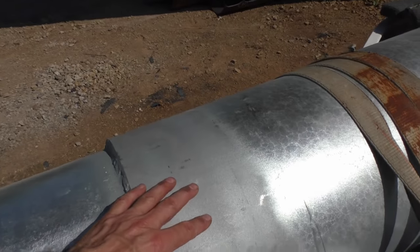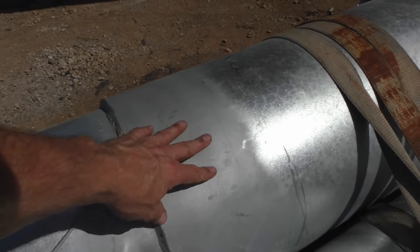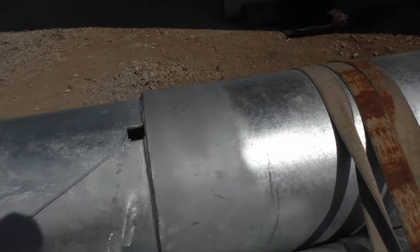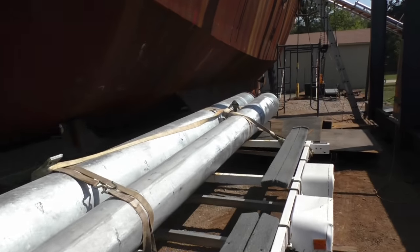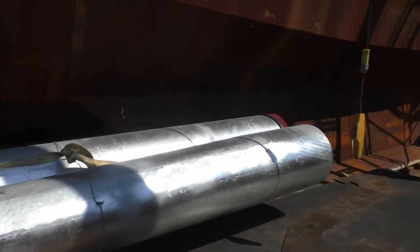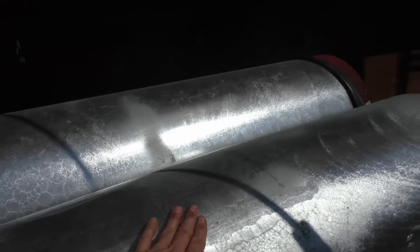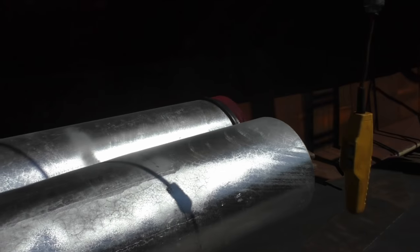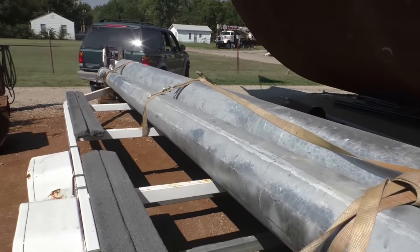The other thing about galvanizing, besides not having any air pockets, is you can't have any coatings on it. You can see they've touched up some areas with a thermal spray, galvanizing it after the fact — after it comes out of the tank they find the bad spots and hit them. But what we had was some coating or paint, and they don't like that. They took a grinder to it and ground it off. They were being nice this time, but next time they expect it to come in ready to go.